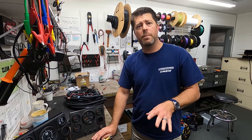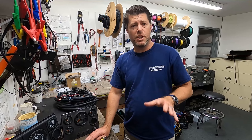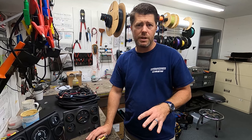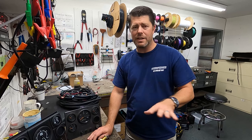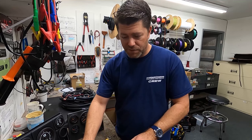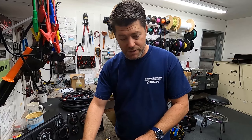The SMX Digital View screen can actually work with any mechanical engine out there — it doesn't have to be a Cummins engine. The harness we have here is specifically set up to adapt to a Cummins engine. This is what's called an 8x10 molded connector — there are 8 pins here that handle most of the start, stop, and critical engine parameters, and then we have a 2-pin connector that gives us the ability to add additional sending units into the system.